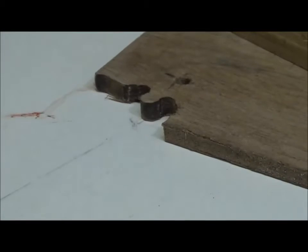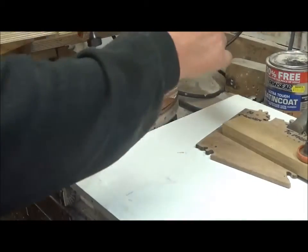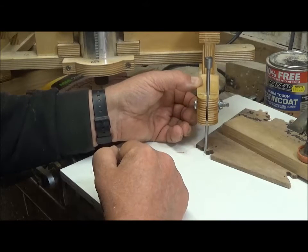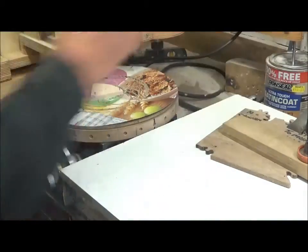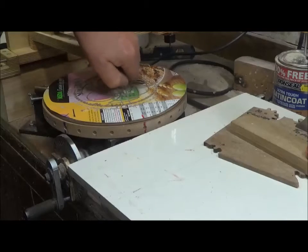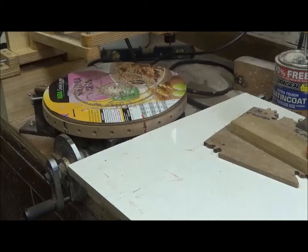This is the single-tooth template for producing the pinion. It's best to do these one tooth at a time, and when making the template it's actually best to round the tooth off — although it should be an involute tooth, with small wooden pinions it's better to round them off into what you'd describe as a teardrop-shaped tooth. In this case it was eleven and a quarter turns between teeth on the rotary table, so it's just a matter of cutting one tooth, advancing eleven and a quarter turns, and repeating until done. For a thicker pinion, make two and glue them together.